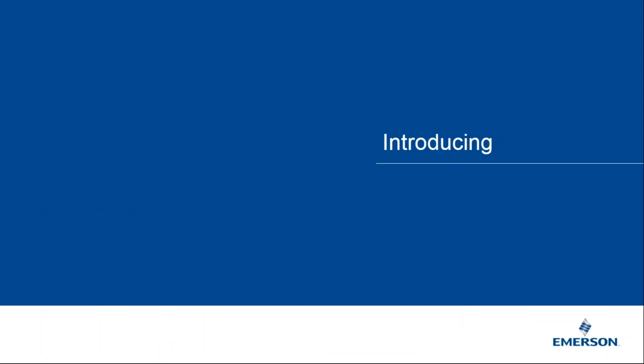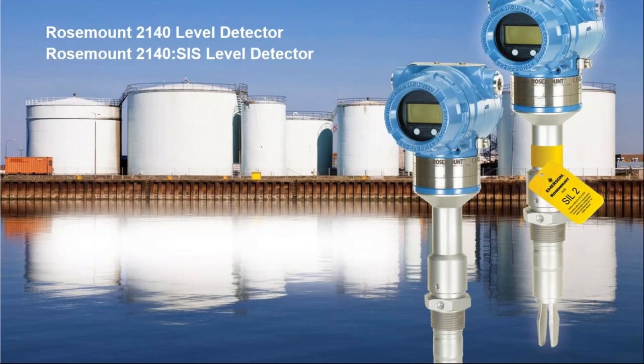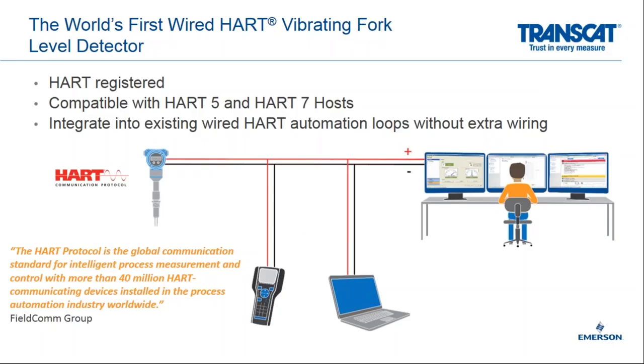So if we look forward into the future and take a look at our newest product, we're looking at the Rosemount 2140 level detector and the Rosemount 2140 SIS level detector. And again, these are the world's first HART level detectors. You'll notice the distinction I'm making: detector rather than switch. These devices are now fully HART, and this device can be put on a loop similar to a 3051S pressure transmitter or any other loop powered device. These are fully registered HART devices, HART 5 and HART 7 compatible hosts. And again, we have this digital infrastructure to wire our products back into your plant infrastructure.